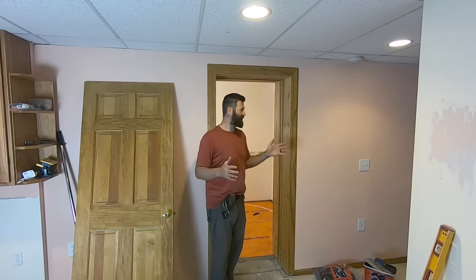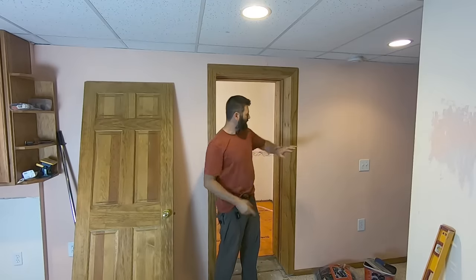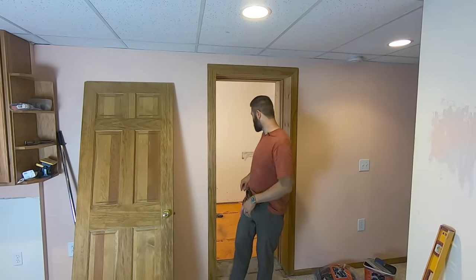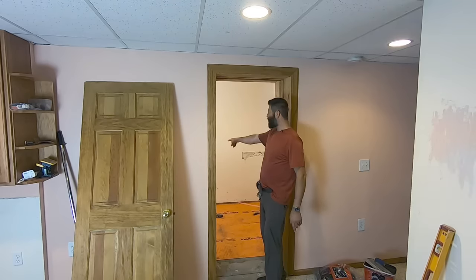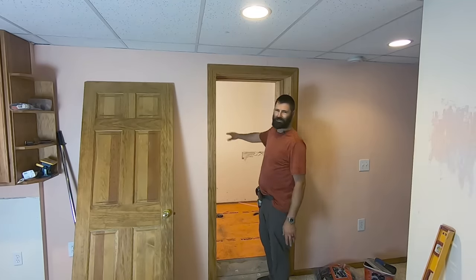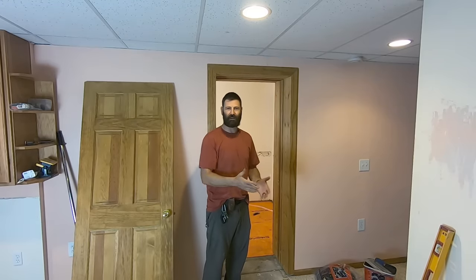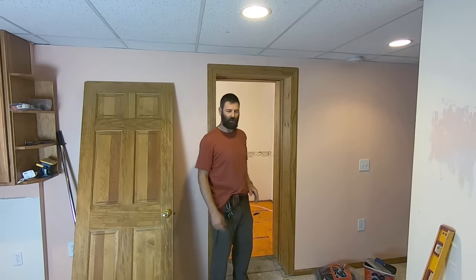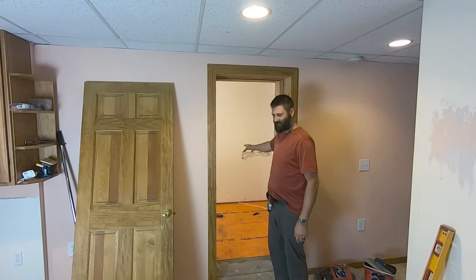There's a lot of walls and there's a lot of grout joints — how am I going to lay this out? There are a few walls that are going to be exposed. Pretty much everything in this room is going to get covered up. We want to focus on the most visible area so that it looks straight. I'm going to start by measuring off this wall and that wall to get some perpendicular lines and see how they transfer in here.